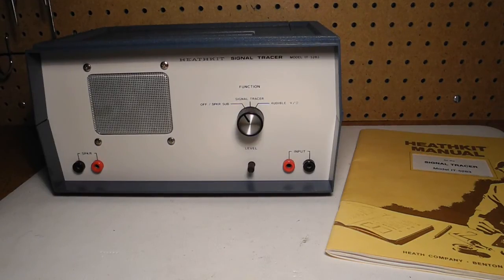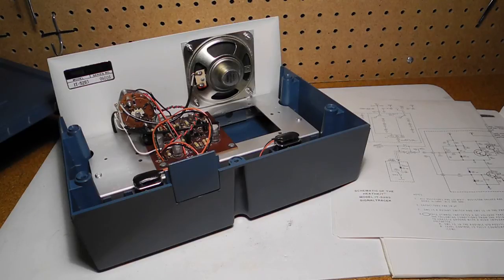I bought this unit on eBay in May 2015. It did not come with a manual, but I found and bought an original manual separately. When initially tested, I got some hum in signal tracer mode and oscillation on the audible volts per ohm range, but the volume was too low. I measured the DC voltages against the schematic and found some were okay and some were significantly off. Going through the assembly procedure in the manual starting with the printed circuit board, I immediately noticed that three resistors were the wrong values. I replaced them with the correct values, but unfortunately the unit was still not working any better. The remaining parts and wiring were verified as correct. I then connected the unit to a signal generator and started tracing the signal through the stages using an oscilloscope. The signal looked good until I reached capacitor C7, where it stopped. C7 was indeed bad, and after replacing it, the volume increased greatly and the unit was now found to be working correctly.